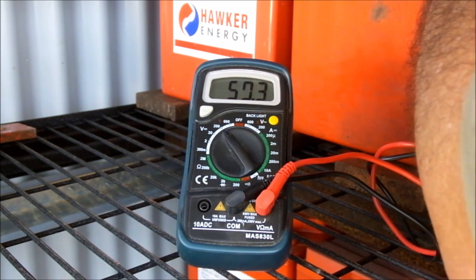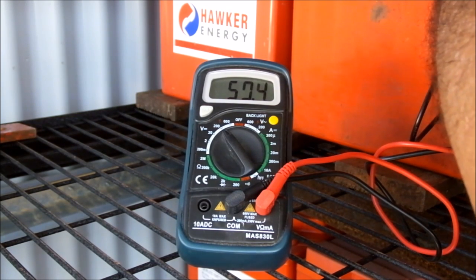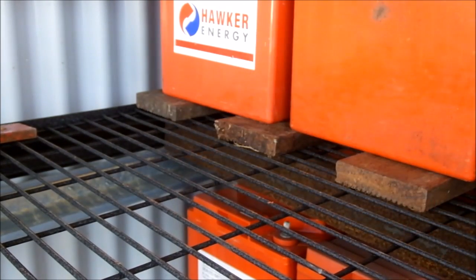But I really need to get some charge into these, so the next few weekends are going to be fairly busy. That bank there is 48 volts, 127 amp hours — that's just over six kilowatt hours, or six thousand watt hours. Now out of that I can safely use 30%; I never want to go below 70% state of charge. So out of that battery bank I could use 1.8 kilowatt hours without any hassle. Thanks for watching, I'll talk in another video.